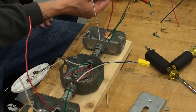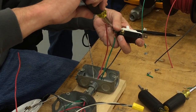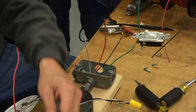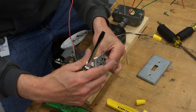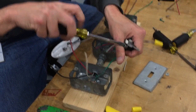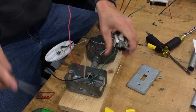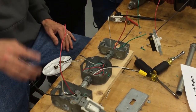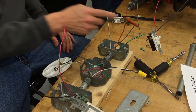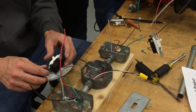So now all that's left is the three-way switches. I'm going to go ahead and hook the ground on first — tighten that up. Hook the ground up over here. Now, which ones did we say were the most important? The common. Which one's the common? The black.